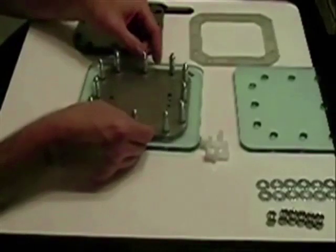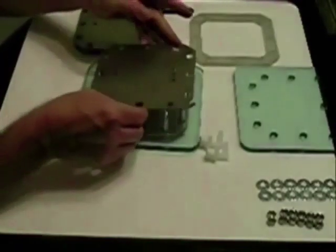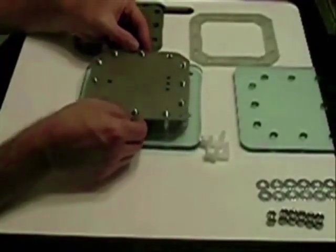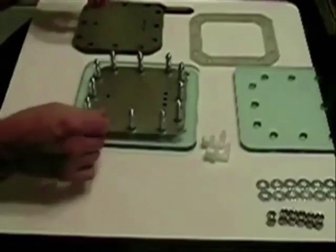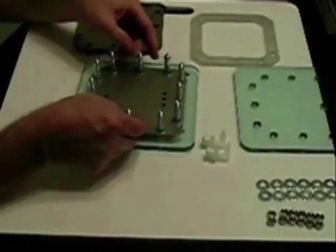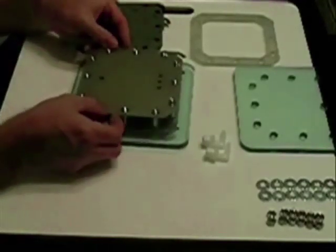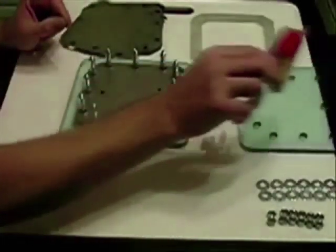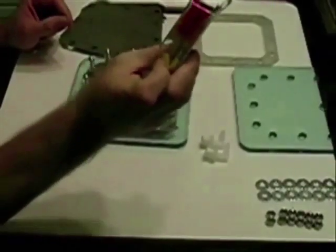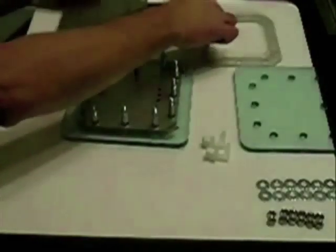Come back with another gasket. These plates have already been cleaned, sanded, and cleaned again. Come back with a second plate, drop it down, go with another gasket, another plate — alternating every other plate. You could put all the connections on one side, but that would not give you enough room to make your electrical connections. We want to use 10 gauge wire so it won't get hot.